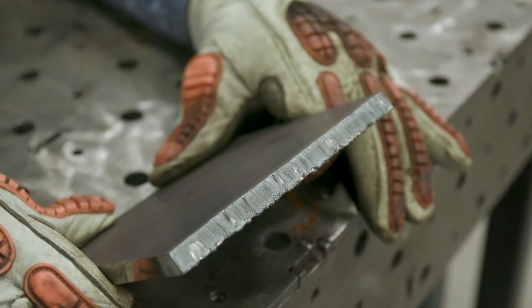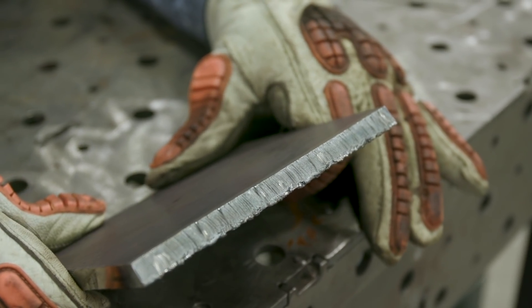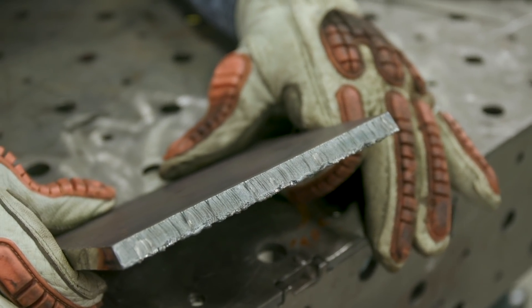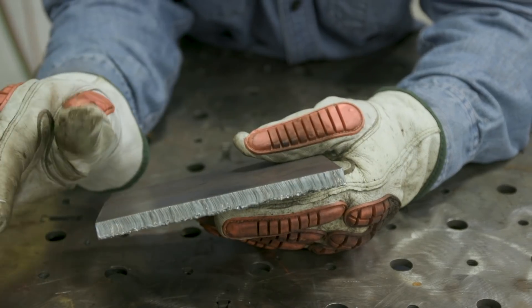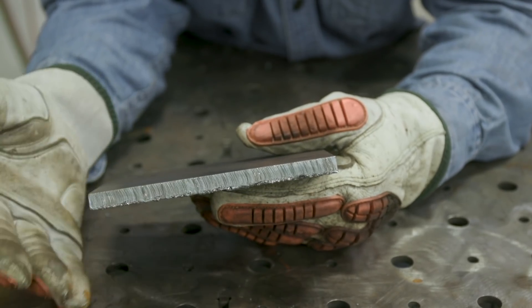You're adding some additional expense to that. In addition, we have some post-cut cleanup — I have a little dross on here that I have to get rid of. So I'm going to have to use a grinder on this to clean that angle up and get rid of that dross. So that's oxyacetylene.